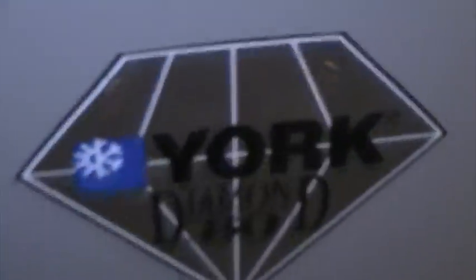It's got a pretty decent install. That's the condensate, so that's not good. You want this for the pressure to flush it down. Diamond 80, 90,000 BTU 2001, builder grade gas furnace. It's running in cooling mode.